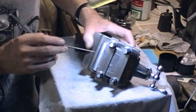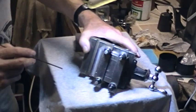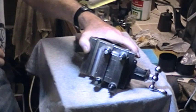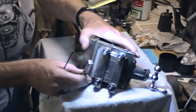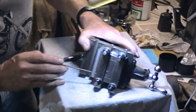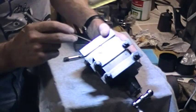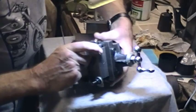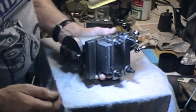Because I've got no milling machine as such I have to use the vertical slide as best I can and put a cutter in the three jaw or the spindle depending on what cutter. I tried three cutters — the shell end mill, another large end mill, and a three quarter and half inch. The problem is just the sheer amount of time it takes to get rid of material. This has quite a nice finish but we're barely a third of the way down and that took forever.